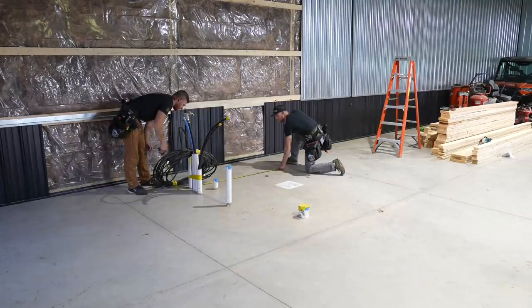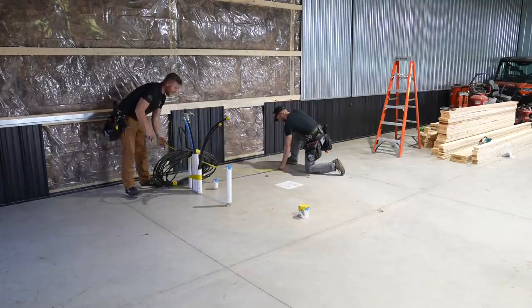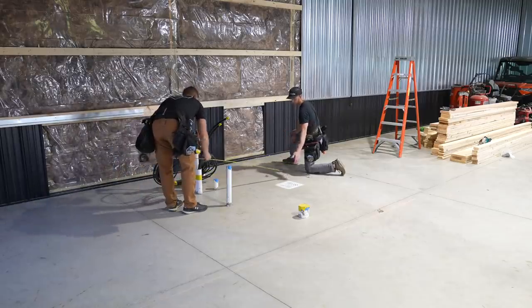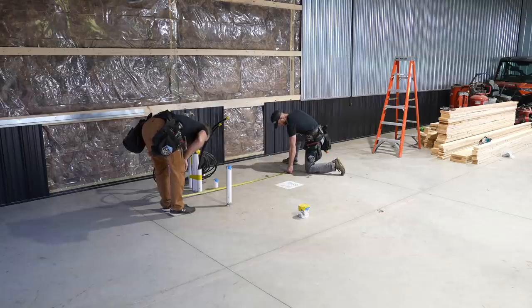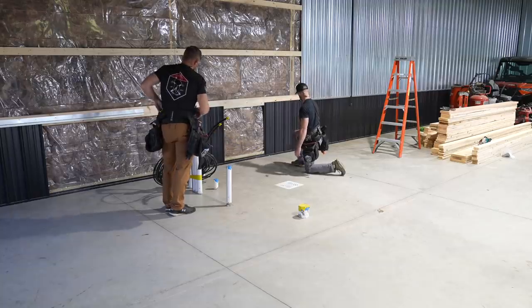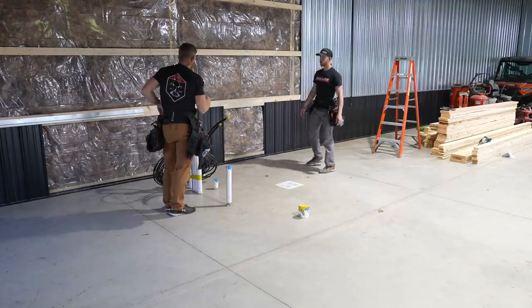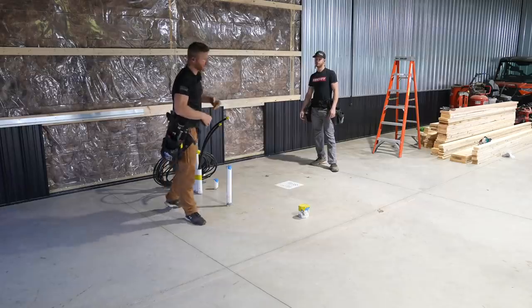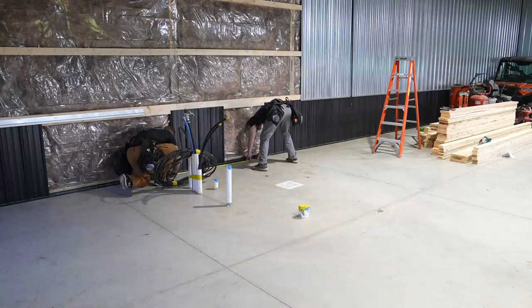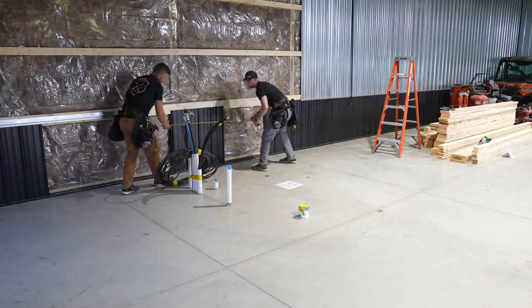So that's 66 on the worst side, and then this one was the furthest on the other, which I think I saw 70. So that's only 4 inches. It means we had 1.5 inches total. So 3/4. So that means let's go 65 1/4. All right, let's snap that.